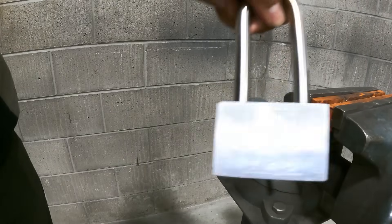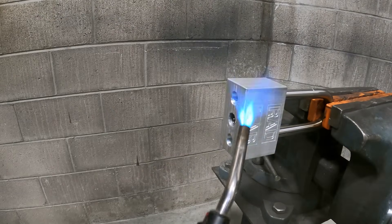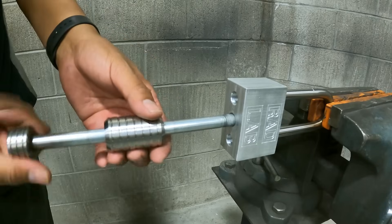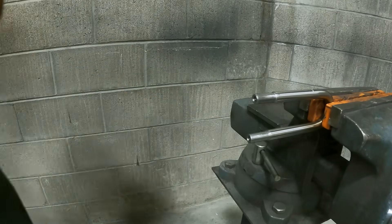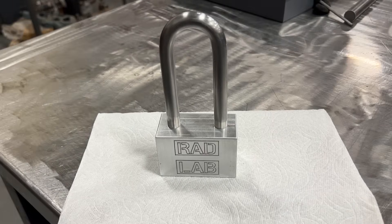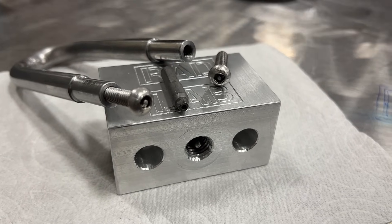You put the screws through the lock into the shackle for extra security, then wait for the whole thing to cool down. To take the lock apart, you do the opposite: take the screws out first, heat up the lock body until it's really hot, screw in the slide hammer handle, and while pulling and using the slide hammer, knock the lock body back off. It's a convoluted lock to use, but a really cool use of tight machining tolerances and scientific principles. We'll send it to the Lock Picking Lawyer and see what he does — obviously he's going to lock pick it, but it'll be interesting to see how. Thanks for checking out the video, see you guys later!